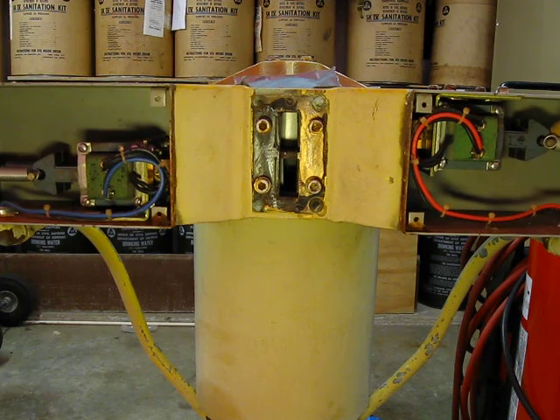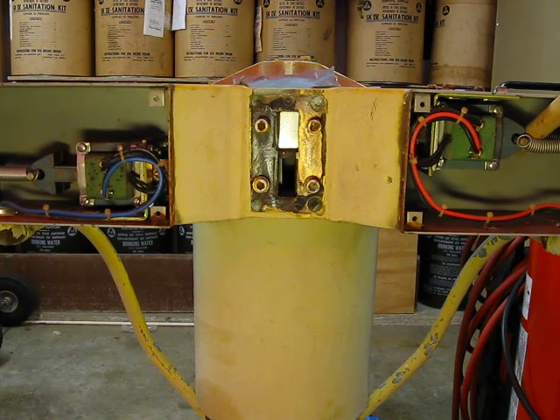The solenoids alternately open and close when it does a high-low signal. When they're not energized, they're open; when they're energized, they close. You can see the shutter valve close there.